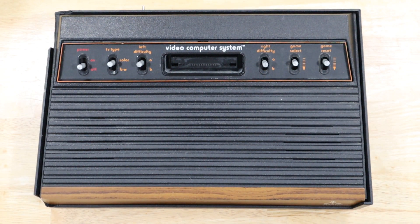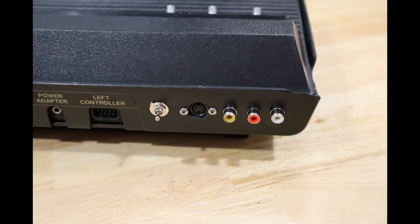With it all said and done, there's a few things I would have done differently. The first thing is to actually go slower on drilling my holes in the case — there's a few chips and cracks from where the plastic was really brittle. The next thing is I would have prepped all my wires before soldering, like I did the second time. And when I was soldering to the main board, I would have done that before installing it, so I'm not soldering over top of the motherboard of the Atari. With it all said and done though, I'm very happy with this mod and it was a lot of fun to put together. If you liked this video, give it a thumbs up and please consider subscribing for more.